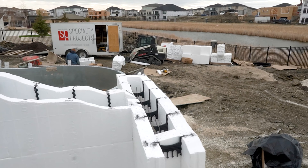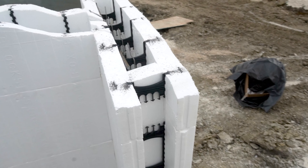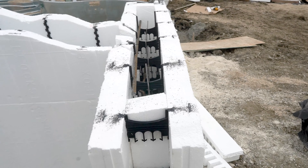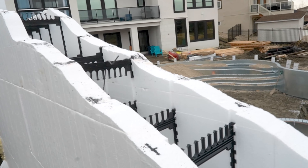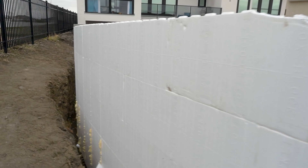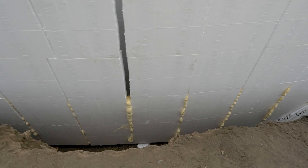Here are some clips on how we're doing this work. Nothing is leveled — there's no level at all. This is a four-inch compact. We just use cutoffs of foam and put it behind the web, and when we place concrete that's going to hold it all. We could cut this off after, but Randy's rock work means he'll just build around it and sculpt it a little bit. We went wild with a reciprocating saw, got some clips hanging out there that we may or may not need. We've got a little bit of rebar for tying, but we're using helix in this wall so you won't need a whole lot. You can see the curve happening here and the cuts to help create it.